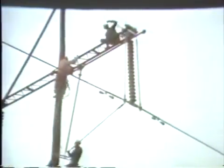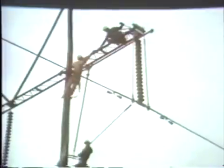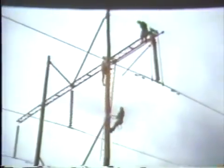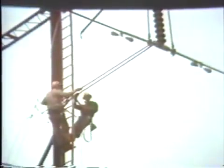The padded hooks are tightened on the conductor using a grip-all clamp stick on the eye screws provided for this purpose. To get a better working position, an epoxy glass ladder is hung over the arm. This will enable linemen from positions on the ladder to reach out with hot sticks and release cotter keys and maneuver the insulators to release them.